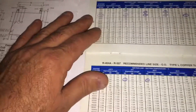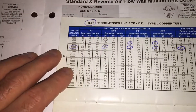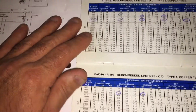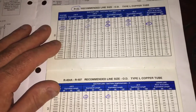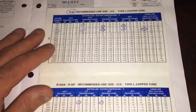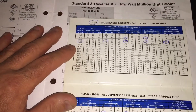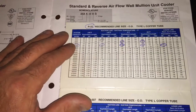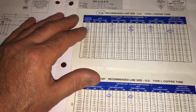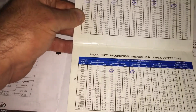For those who like to put smaller lines going into expansion valves: if the factory could make the TXV inlet and outlet smaller to save money, they would. They don't make it bigger just to spend more money. You should be piping to match the inlet size of the expansion valve, because that's the size they want entering it.